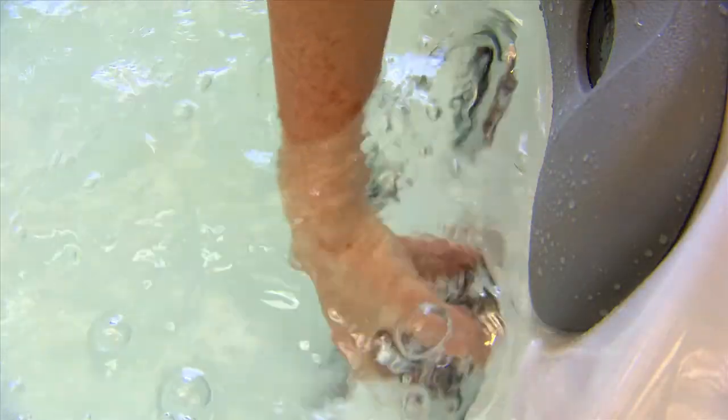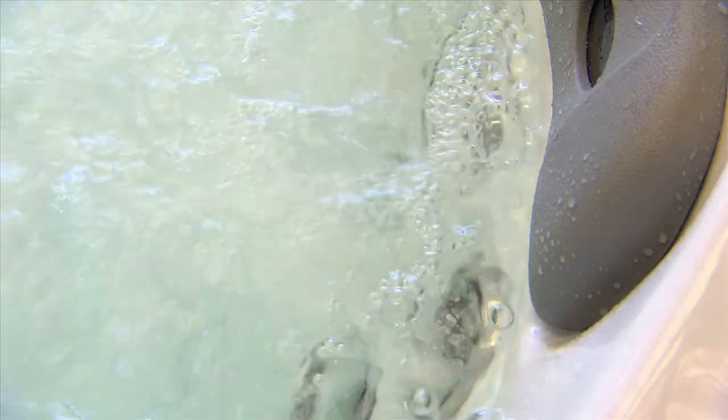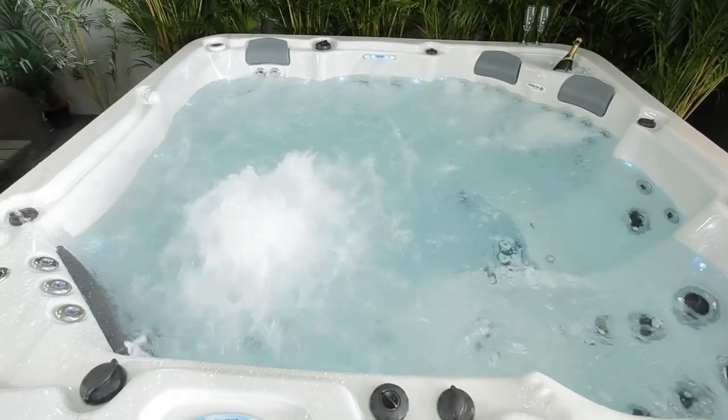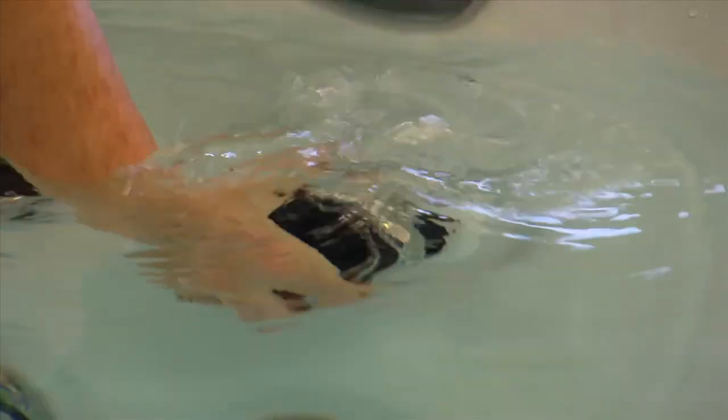And turning the outside rim of each adjustable jet will adjust the flow from full to off and all strengths in between. If you want to swap different jets around the spa to create a different type of massage, you can remove the jet faces by turning the jet off, then twisting it sharply and then unscrewing the face. You can only swap jets with the same diameter.